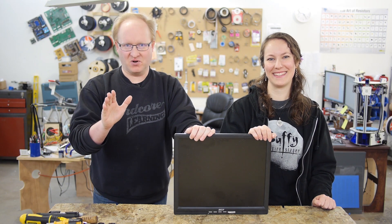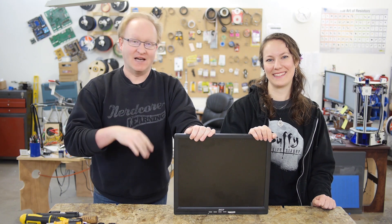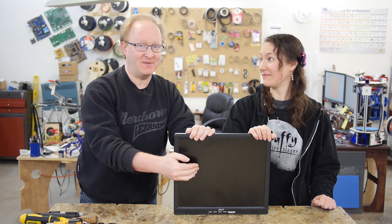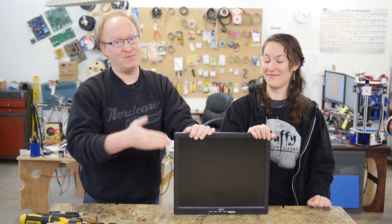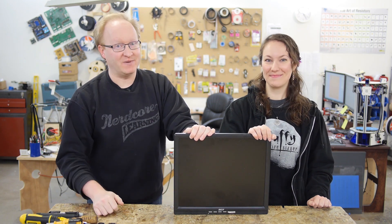Hello and welcome back to the Ben Heck Show. In a previous episode we showed you how to get started using FPGAs, and for an example we hooked an FPGA up to a monitor and created a VGA signal with big fat pixels. Ben's friend Parker Dillman gave us some great Game Boy code, so we had the idea to use this monitor and scale it up to make a giant Game Boy. So that's what we're going to do today — hook a Game Boy up to an FPGA, use that to make a giant Game Boy screen off a real Game Boy, and then build a giant Game Boy around it scaled to the screen, with giant workable buttons and everything.